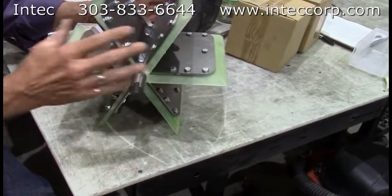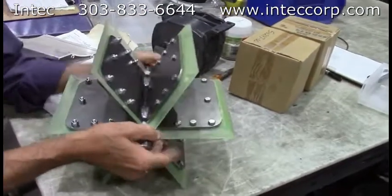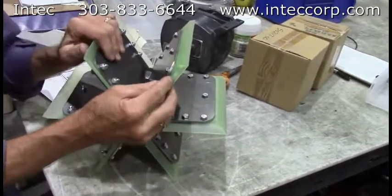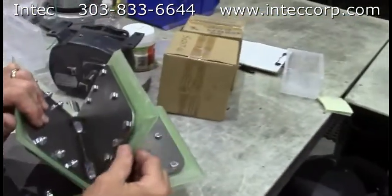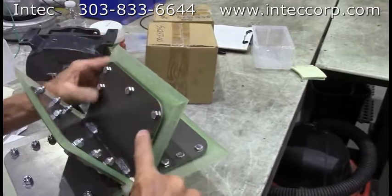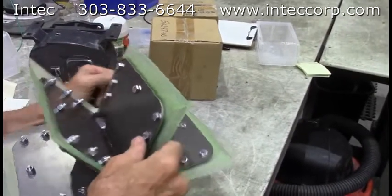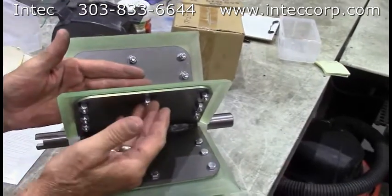This airlock — you can see the seals installed — will turn in this direction. The seals in our machines always drag in the direction of rotation and are installed pointing backwards. You'll notice the bolts that hold them in here. When you put your new seals in your airlock, use a 7/16th wrench here and here.